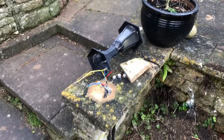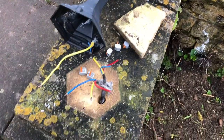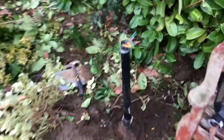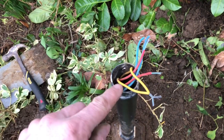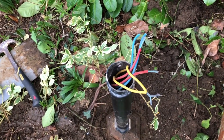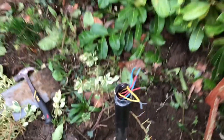We've been on the job now for about two hours. That's the second light we showed you initially. What we've been doing is separating all of the lights — we've got all of the connections there now. On this one I can't tell which is the earth, which is the supply, and which is going off to the next light, so we've just connected the earths together.